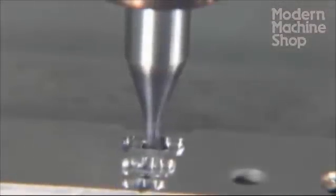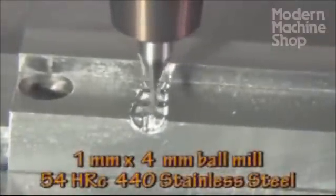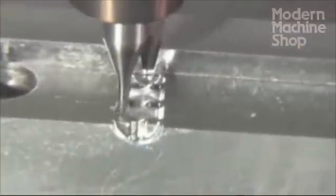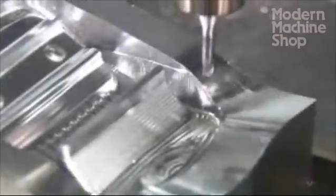This emphasizes how important it is to rough with as stout a cutter as possible or practical. The huge difference in productivity with various length to diameter ratios also underscores a key concept in micro-machining: start with the end in mind. When planning your job, figure out from the start what your smallest cutter will be, and that will make your other cutter path choices easier. Evaluate the smallest details and the depth of those details to establish a logical flow of material removal.